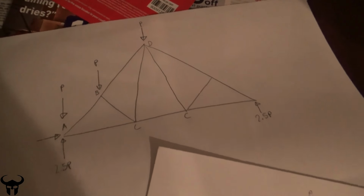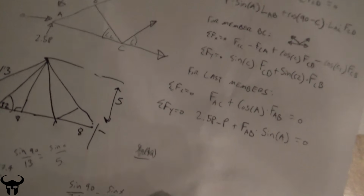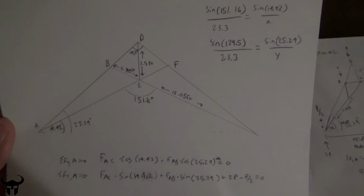So doing this design work for the trusses was no easy task. I started off with a couple different ideas. I started off with, you know, the traditional truss style. So I wanted to calculate the strength in the existing trusses. And I went through iteration after iteration after iteration of different ideas. I calculated metal trusses. I calculated different cross-sectional areas of wood, different configurations. And then I ended up at the final design right here. And it's nights of just trigonometry and strength calculations in the trusses.